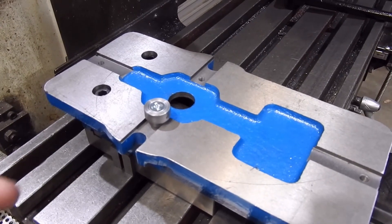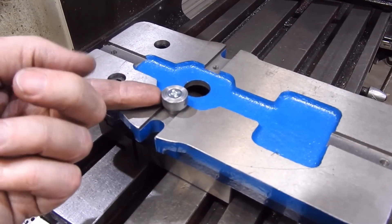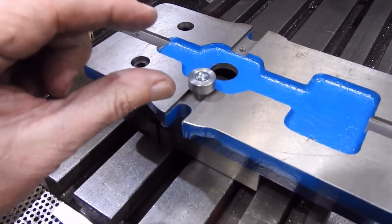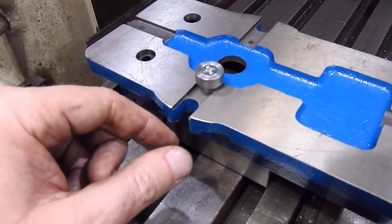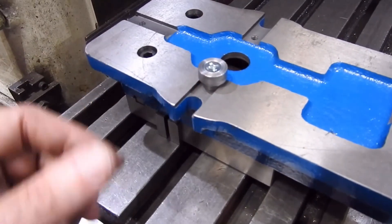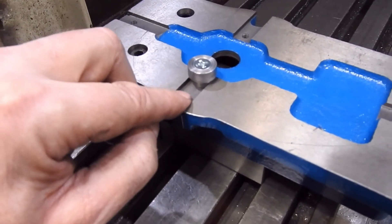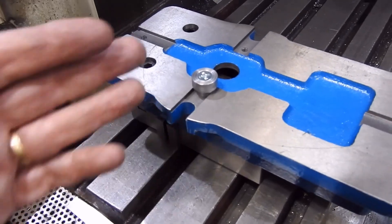For those who are a bit undecided, there is a third option — a round pin like this. I've made it a mushroom-shaped thing with a countersunk screw. If you haven't got room for a countersunk screw because your T-slots are too narrow, you could just put a long grub screw in there and secure it with some Loctite into a bush. That acts as a pivot, so it will sit in the T-slot and let the vise pivot as you gently tap on the sides with a soft mallet. It saves the problem of not quite having the tension right on your T-bolts and therefore having the vise move laterally as well as pivot.